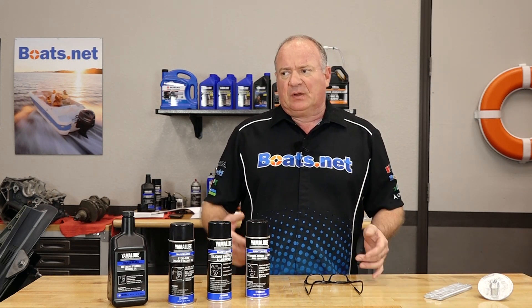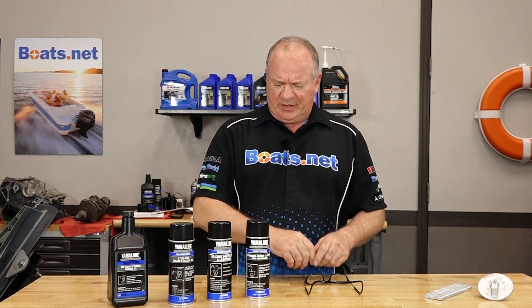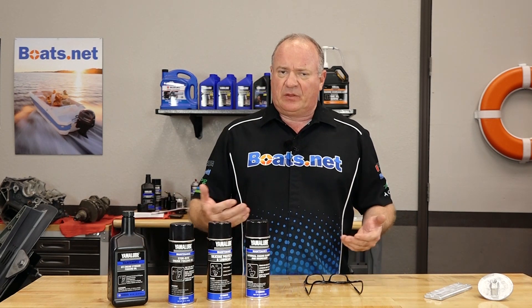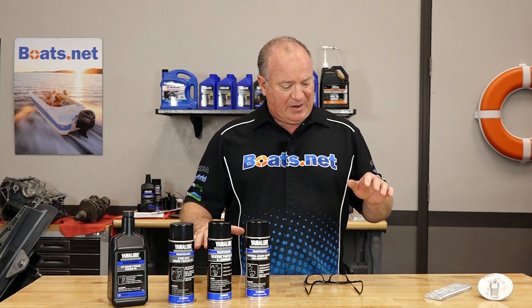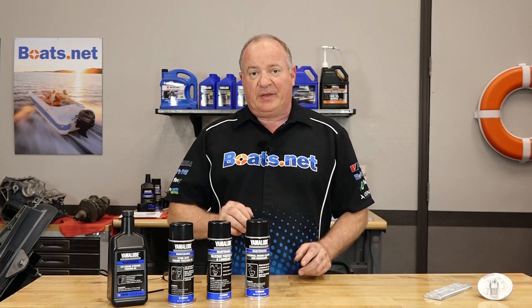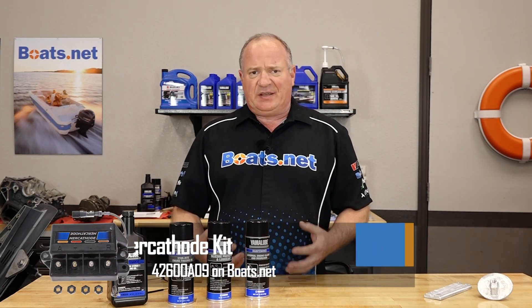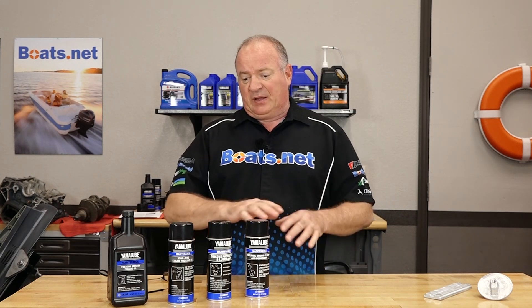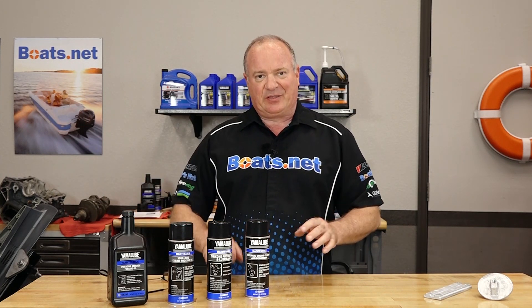Outside of making sure that your anodes are in good shape, you also want to make sure that your boat is properly bonded together. When I say bonded, I'm talking about your different electrical and/or mechanical aspects of the boat — they need a common thread to keep them at the same potential difference. Otherwise you can run into that same galvanic type scenario where one component is at a higher potential than another and it eats it alive. One of the best systems out there is the Mercathode system by Mercury/Mercruiser. It is a solid state system operating off your boat's 12-volt battery, integrated into the engine and out drive, and it actually produces a reverse current that shields off the galvanic type current trying to attack the metals of the engine.